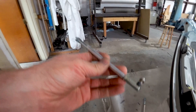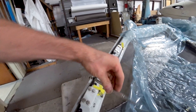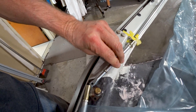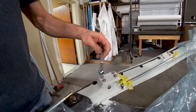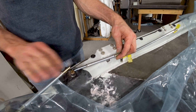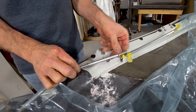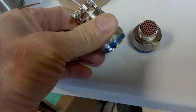These are a couple of the push rods for the door actuators. They all had little flexible ends on them, but this particular one I wanted to change out to a fork end, because the door trim goes right where you see the paint change. If it had the regular rod end on it, it would have been sitting too high and the door trim wouldn't sit down. So I had to change this out and put that fork on there — it sits much closer to the frame and is much more low profile. With the fork end it's lower and will be a much better fit where the door trim goes over that.